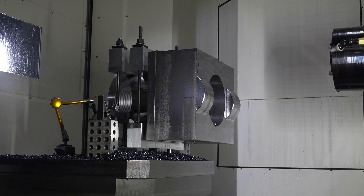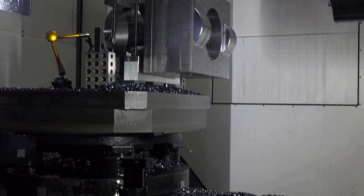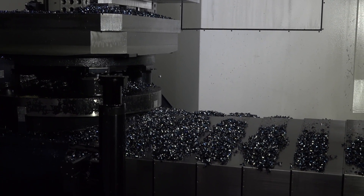Obviously the fourth axis. The fourth axis horizontal is just better than most three-axis verticals. It's got the pallet changer. It keeps track of things really nicely when I've got to do rotating of parts like this one right here. I'll have to tack it from all three sides, so it keeps all the eccentricity nice and all the origins in the right position. Radial compensation works really well on the machine — it's such an important feature when you're working on so many faces of the part. You want to be able to clock everything in, and when you rotate it's actually a 90-degree rotation.